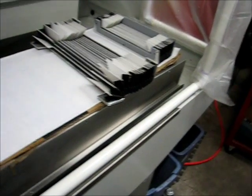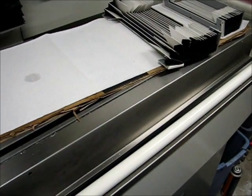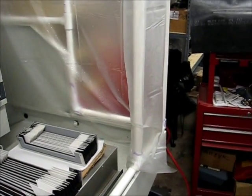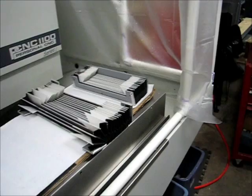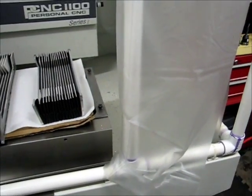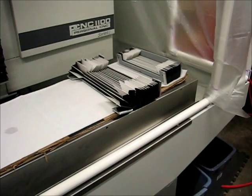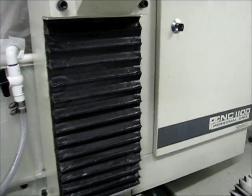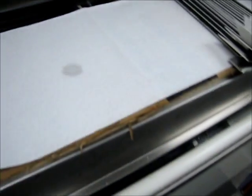When the table is out this way, chips fall and make their way down between the chip tray and this stainless steel guard on the front side of the table, then sit in the tray and run off the side. However, with the coolant enclosure that I built, I don't have any reason to have that chip tray or chip guard around the table — it wouldn't fit in there properly at the limits, and the shower curtain in the front would also interfere with it. So I took mine off and next thing I know, I've got chip buildup on the front bellows as well. So I'm going to be building a neoprene bellows cover for the front as well. I'll have new bellows on the Z and the Y rear, and neoprene guards over all three.